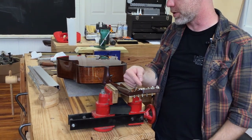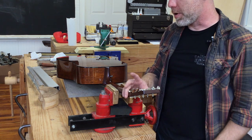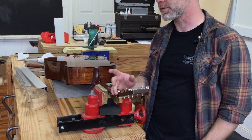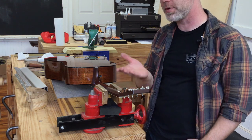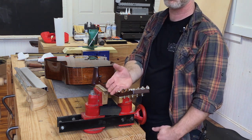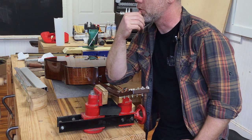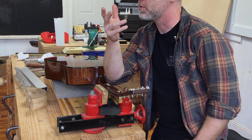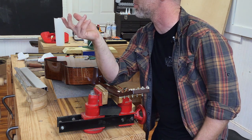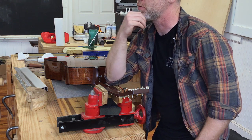The splints that run this way, those could work, but you gotta remember, most guitars have a scarf joint. Not most guitars, but a lot of guitars already have a scarf joint. So if you have a headstock break and you get the first crack at gluing it up, glue it up with fish glue. If you don't have fish glue, try to glue it with hide glue. Your Titebond, you're not gonna be able to wash that back out or reactivate it if something happens, you know, if it gets cracked off again.